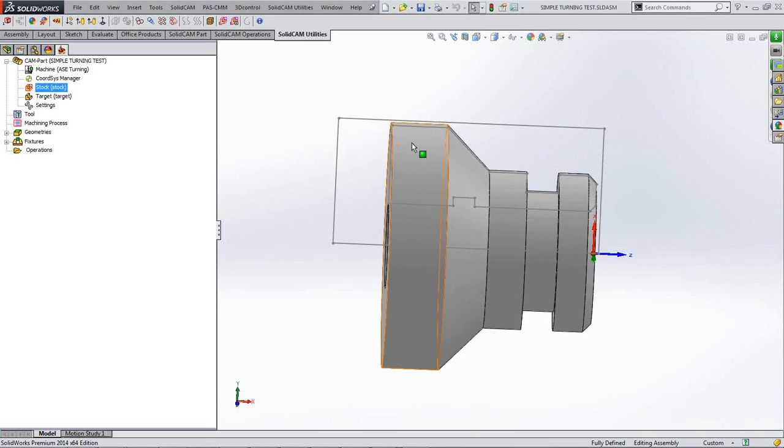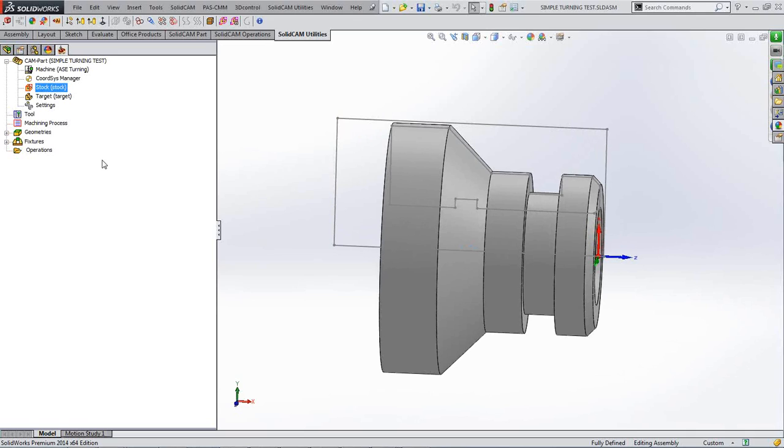When I'm machining this, what I'd like to do is turn beyond the back face of here, just to make sure I've turned it off, so that when it comes to turning it round or parting it off or whatever I'm doing, I can go onto a bit of cleanly turned part. If I was to come to just the end, I would leave a little, your tip radius, a little rag on there. You don't want that neither. So I want to make sure that I turn beyond there, but I also want to make sure that I don't smack into my jaws. So it'd be nice to be able to see our jaws on there.